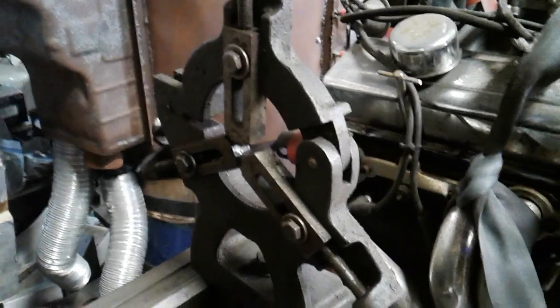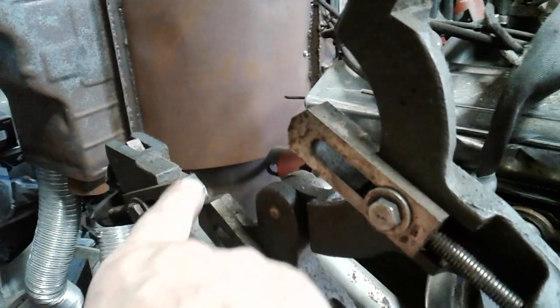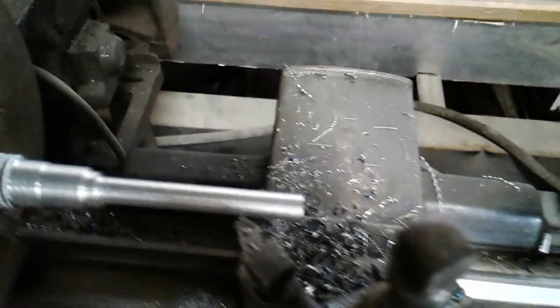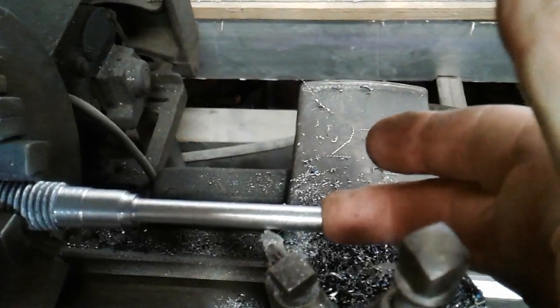One of the things I don't understand is this — what the heck do you call this? It's right on the tip of my tongue... a steady rest, that's what it is. I thought these things were supposed to have bearings in them. Is that supposed to ride right on the material, or what? It seems like there should be bearings inside of that to ride on the material. I know I've got this piece hanging way out in the wind — if I had a live center I would definitely have it up in the tail end and I'd probably get better cuts.